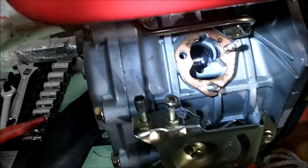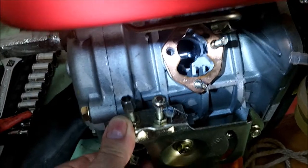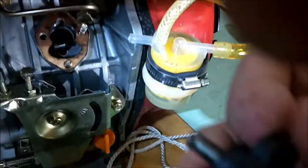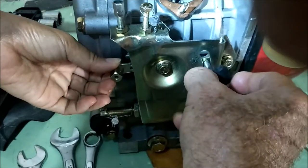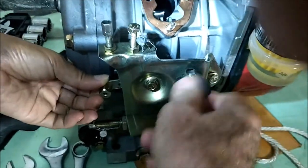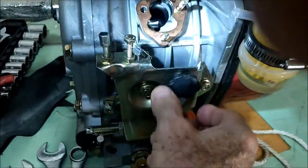When you put this in, center it in the hole. There's a little screw that you can thread into here — it comes with it. This screw actually threads in right here, and you can adjust your throttle to a fixed spot. That way you can lock the engine at a set speed.